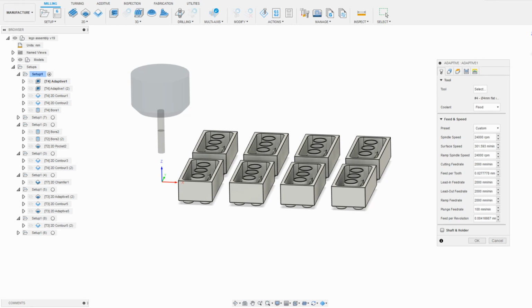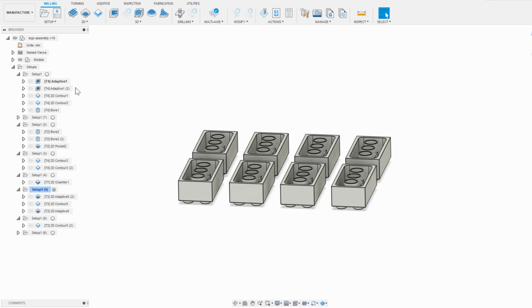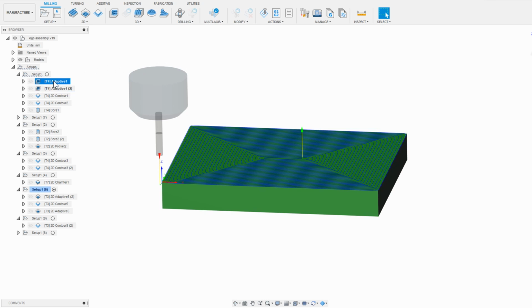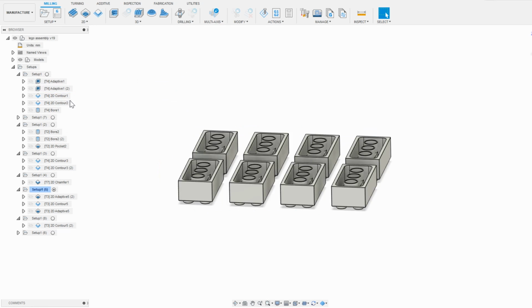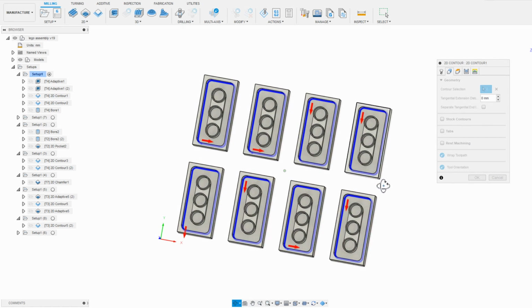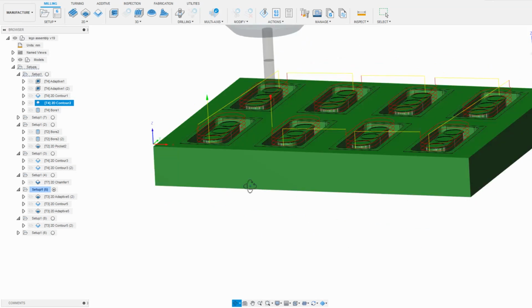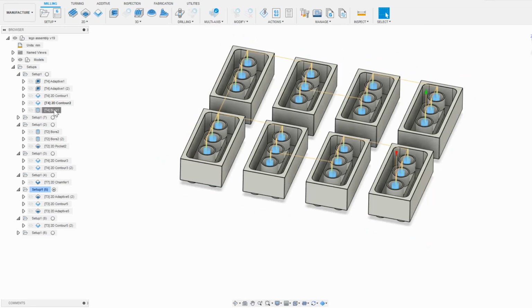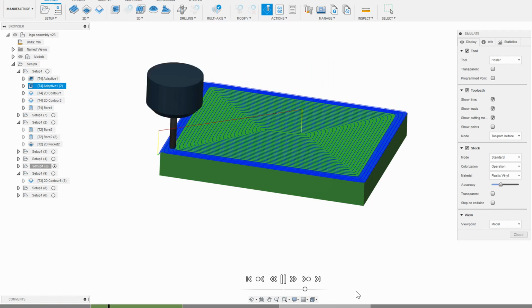This is everything that happens with the 4mm tool in one G-code file. I'm using an adaptive toolpath to remove the material off the top of the Legos, but I've modified it to be a little less aggressive than last time and in 2 passes. After that, the tool will contour down in a ramp on the insides of the Legos, first following the outer perimeter and then following the inner little island for each. Finally, I'm using a bore operation to ramp down and clear out the middle in each hole. I can see this in the simulation, which shows everything the CNC will do.